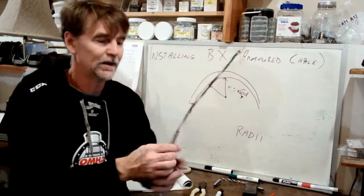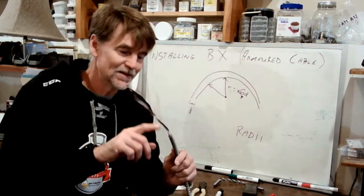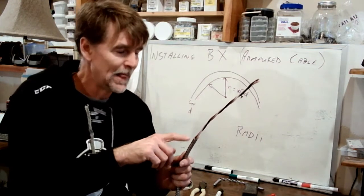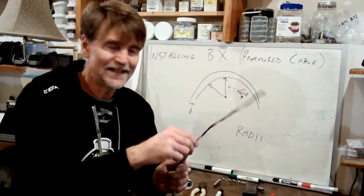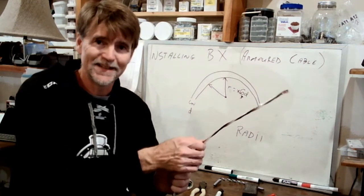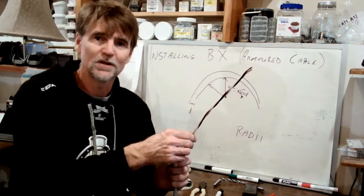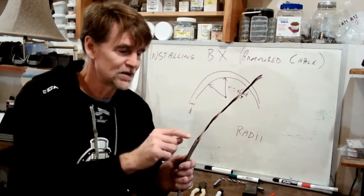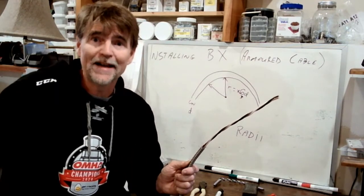We can see we've got our black, white, and our bare inside. Now, the next thing is the sharp edge. I just commented about it: I used it to break the paper off, but now there's a real possibility that this sharp edge could dig into the insulation, especially over time. Once you squeeze this in tight, and if there's any potential for vibration, certainly there's going to be expanding and contracting due to temperature changes. That sharp edge could potentially work its way into that conductor.